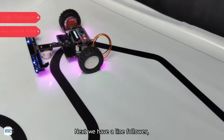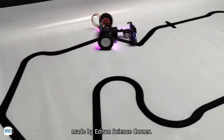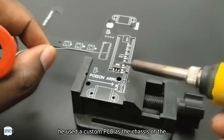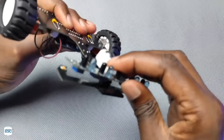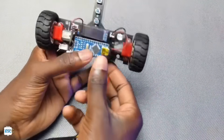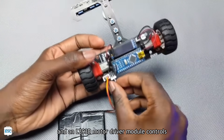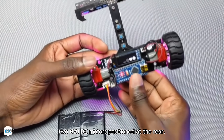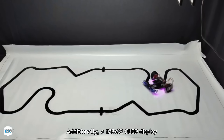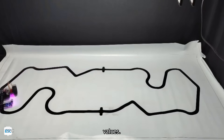Number 6. Next, we have a Line Follower — a sleek and robust robot made by Edison Science Corner. To maintain a simple and efficient design, he used a custom PCB as the chassis. The custom PCB accommodates an array of five IR sensors at the front. The Arduino Nano serves as the brain, and an L293D motor driver module controls two N20 DC motors positioned at the rear. Additionally, a 128x32 OLED display is integrated for troubleshooting, along with three buttons for adjusting values.